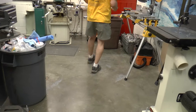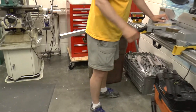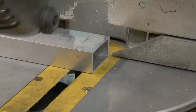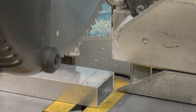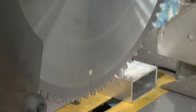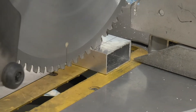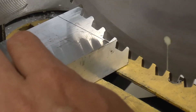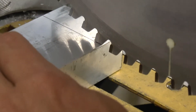Take this back over to the saw. To decide where you want to position it, bring the blade down — making sure your hand is not inside the trigger grip. We'll set this tooth — the left side of the tooth — right against the side of the line. When we're in the right spot, hold it and make sure it doesn't wander on you. Saw!